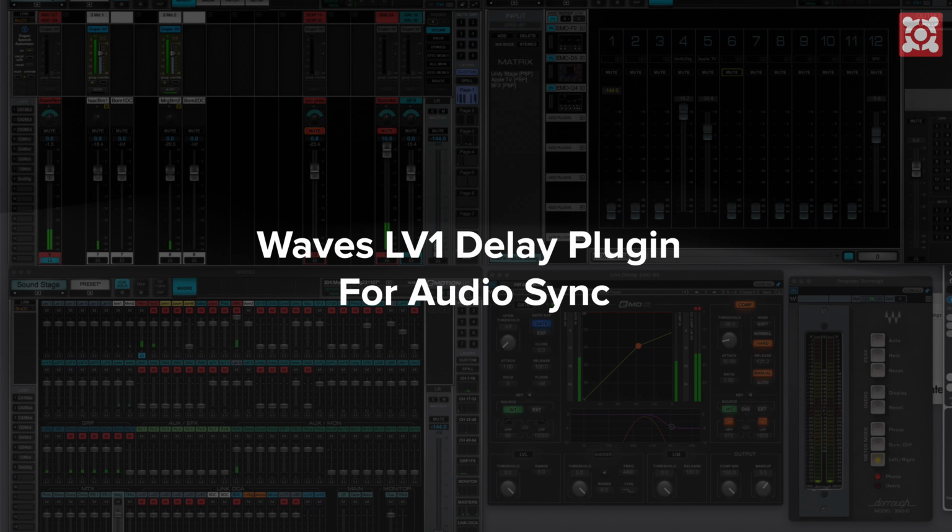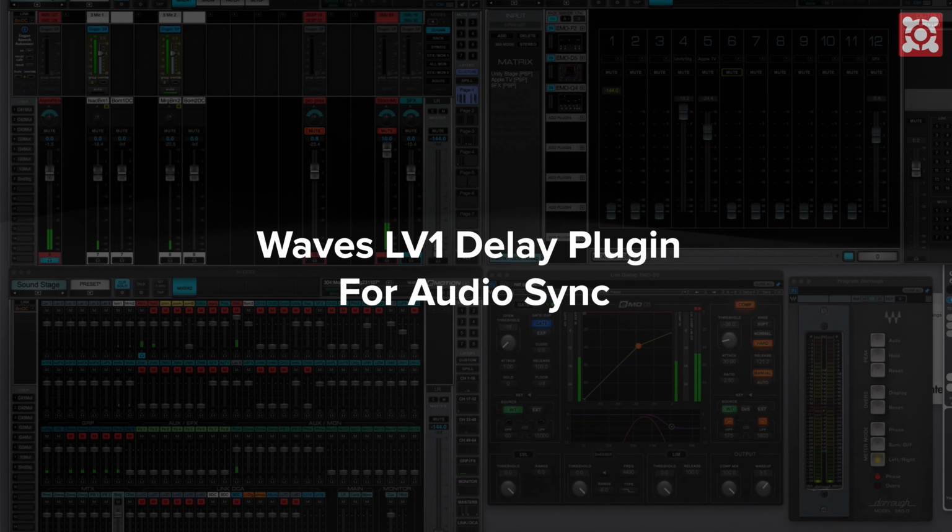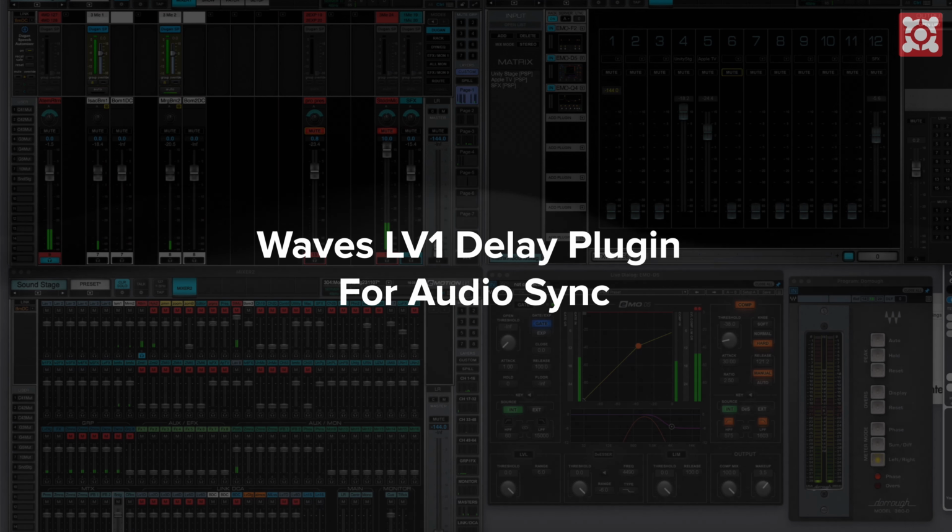Once that was set up, it was as simple as delaying our audio. For us, we're using the Waves eMotion LV1 mixer, and it has a delay plugin that we're able to insert on any of our audio channels or any of our audio outputs. Again, this will vary from audio console to audio console, but most of them have a way to do a delay either on an input level or on an output level.